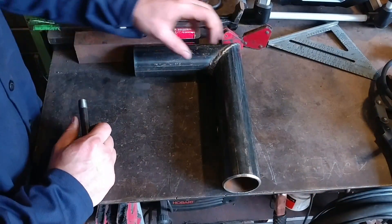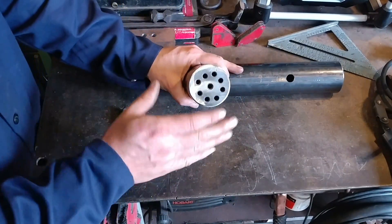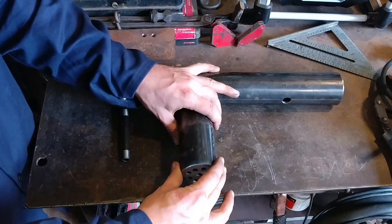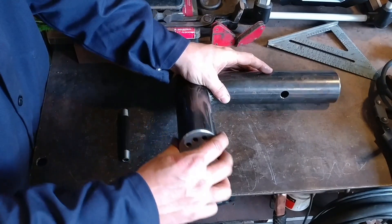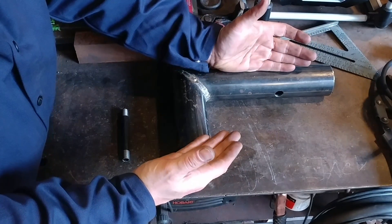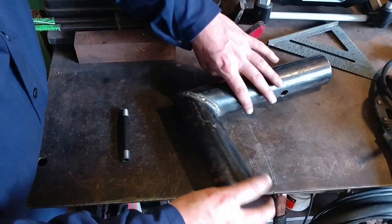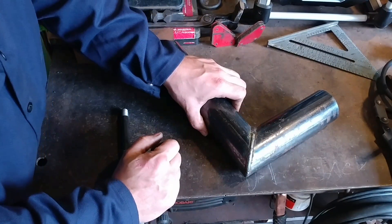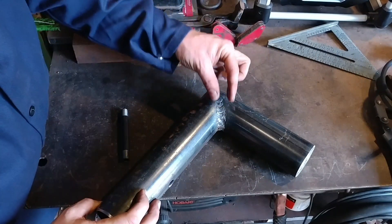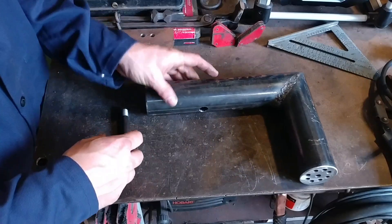Time to catch everyone up. We've got all our holes drilled, everything welded up like in the time-lapse. We've got this nice and flush — this will become our burner, the actual burning end that gets inserted into the forge. I chose a little longer pipes for my purposes. Once again, the length does not matter; the only real critical point is to have that sharp 90-degree elbow. I did not miter my joint well enough, so I had a heavier weld there as well.